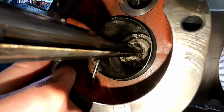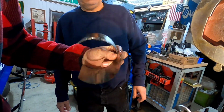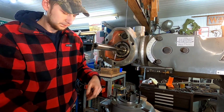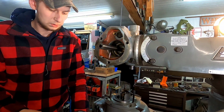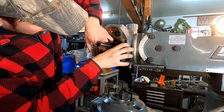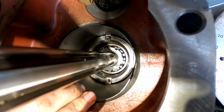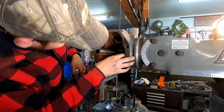We're going to rotate it so we can skip over the little oiler. And here's the old one. Tabs are bent and broken. Put that on after. Past, rotate it, and you can see the tabs there line up with the bolt holes. It's wanting to push it back. I think he had a video, you had to press it past them little tabs. That side's in.